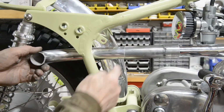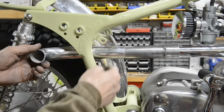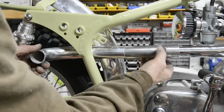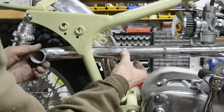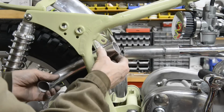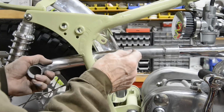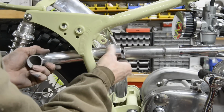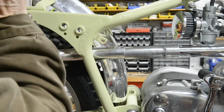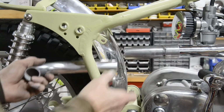Now then, as I say, I've got to weld a piece into the centre there. I'm going to make the ends out of 1/8 inch because there's not going to be a lot of meat to weld to, unlike when I do them the other way. So of course I'm going to cut out of that 1/8 inch a 1.5 inch hole for that to go through. So it's going to leave me with a disc roughly 1.5 inches. I'll have a little hole in the middle from the hole saw, but I'll weld that up and then I'll use that disc in there, and that'll save messing around. So I'm going to go now and make up a cardboard template to see what this end is going to be like. Well, both ends.